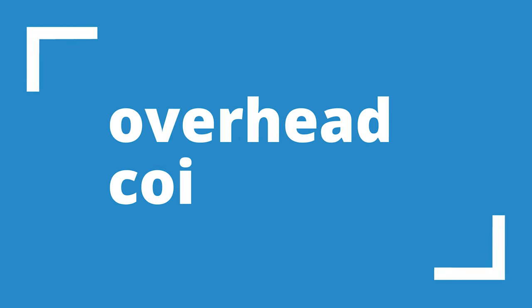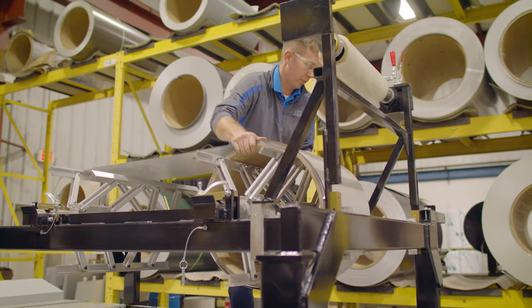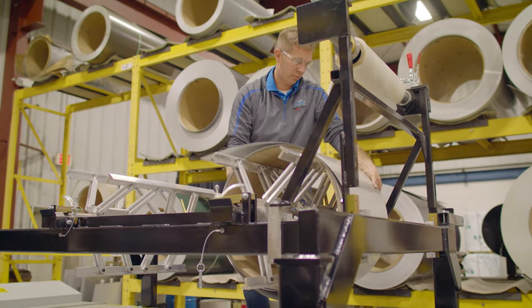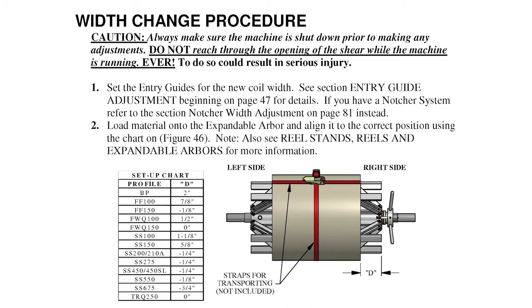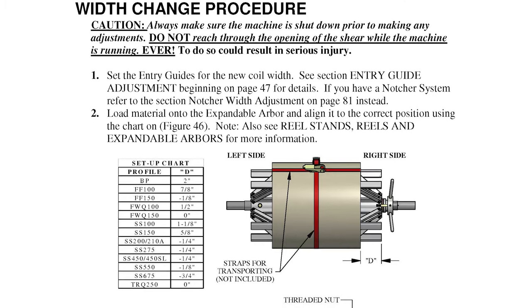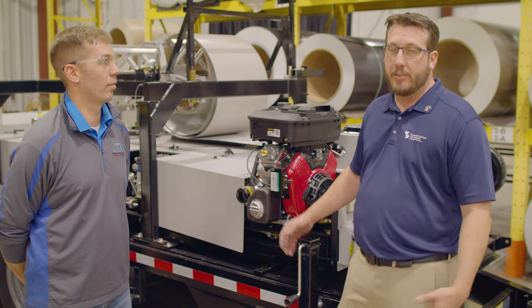Other issues I notice are the setup of your coil on your overhead. This plays into your entry guide. If your coil is not positioned correctly, even though your entry guide may be, it could possibly feed your coil in at an angle which would result in a tapered panel leg. With New Tech, the manual has a chart that shows where the coil should be on the expandable arbor based on the panel profile that you're running. A two-inch panel might be different than an inch-and-a-half panel and so on.